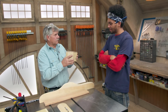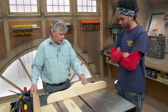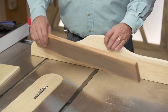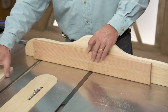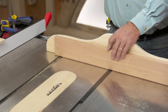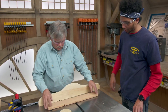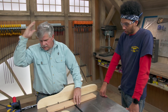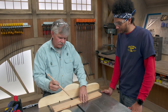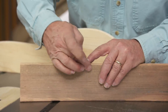The trick to making it fit right is this jig that we're going to make. First, I've attached a piece of wood to our crosscut fence, and I'm going to use another piece of wood I can lean up against it. I'm going to make a run through the blade so I'll have a spot to go by. I adjusted the blade height to the thickness of the wood. Now I've made a cut, and the cut tells me the exact width of that blade. I already know the width of the blade, so I cut a filler piece the same size. I'm going to cut off a small piece and glue it into that slot.